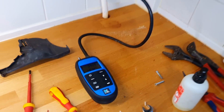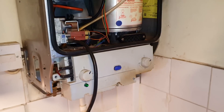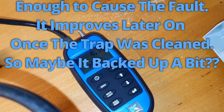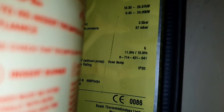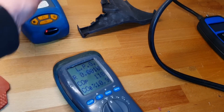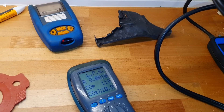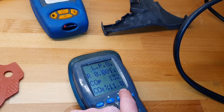We're going to do negative fan pressure and set up the combustion - it looks like the job might be a good one. With negative fan pressure we're going to get loose combustion ratios. We're at 10.8% CO2 - not doing bad, should be 11. That's pretty good - just a wee tweak. It's nice and stable at 11%, print that, and knock it down to low.